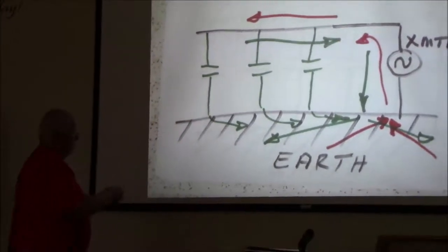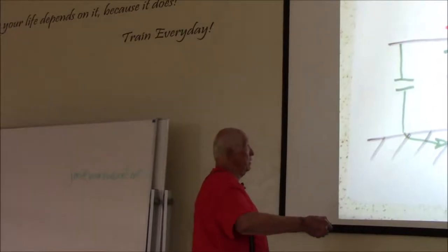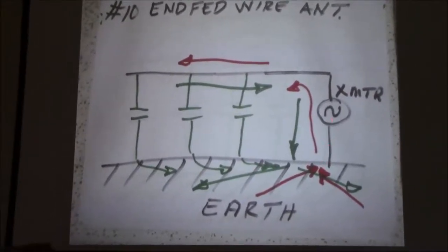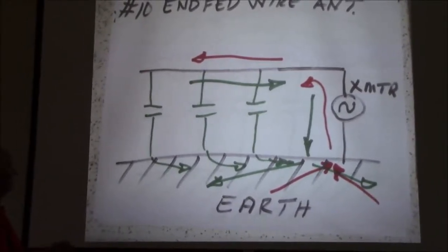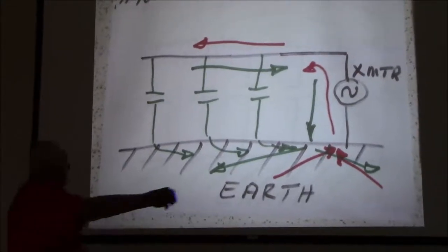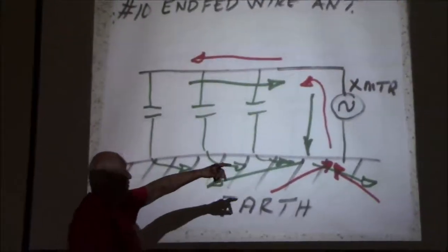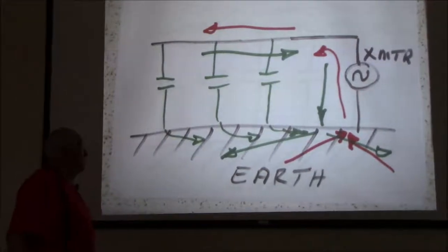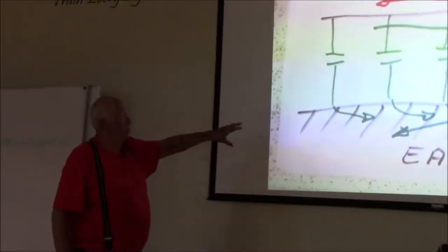But anyway, there's a schematic diagram for it, and you see what's happening is the transmitter is pulling on this end and pumping electrons down this way, half a cycle, and then it's pulling the other way, pulling electrons out of the ground and pushing them on the wire on the other half of the cycle. So we can see the red arrows are one half the cycle, the green arrows are the other half. And that charge motion is accumulating electrons out of the mass of the ground to make up the electrons it needs to create the amount of current that it has to create based on the voltage across the terminals of the transmitter. So that's a schematic diagram of what it looks like when we're using the earth for a ground,